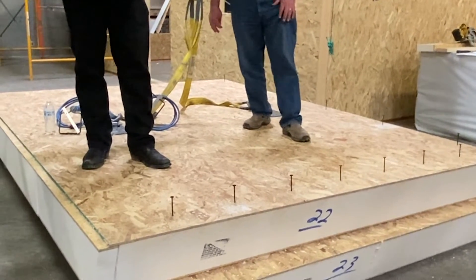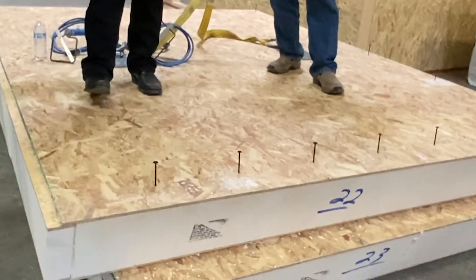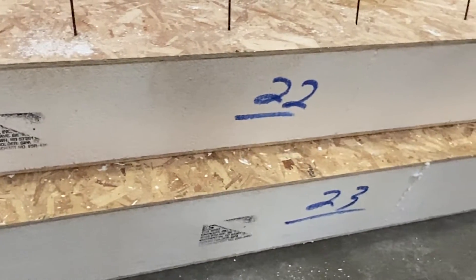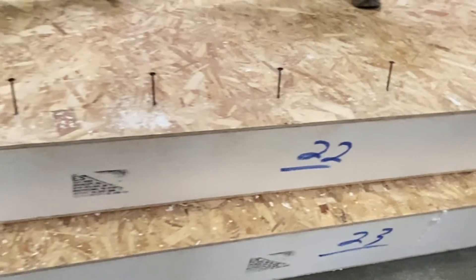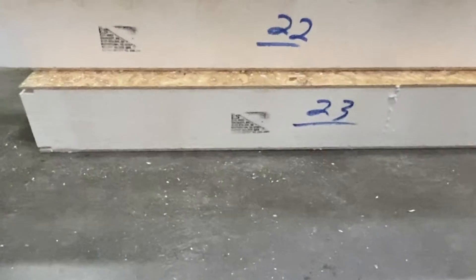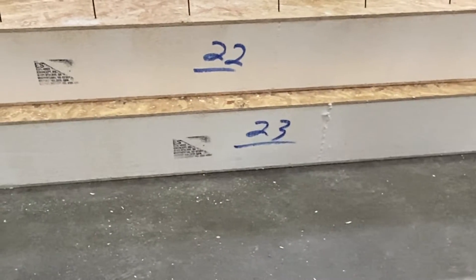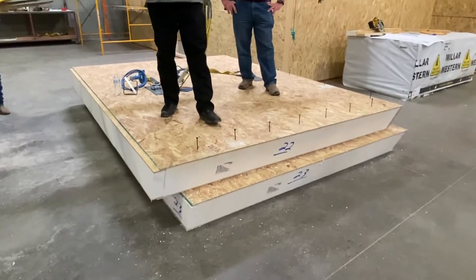Once the panel is in place, the guy with the screw gun can just zip it through. They did it on the gable end as well. The eave is actually the trickiest — that's the smallest margin of error, because it has to go through without coming out the side of the wall, and not so far in that it only hits the cap plate. It's got to go exactly through the cap plate and into the top plate, because that's where your hold-down power is. Do an inspection afterwards — even if you checked it, walk through and make sure screws didn't get bumped to the wrong angle before shingles are on.